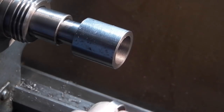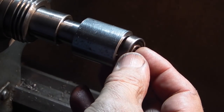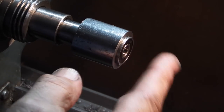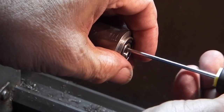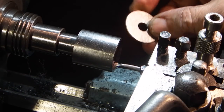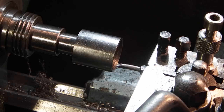I've just finished off the bore. I had to revert to an old boring tool to try and get a decent finish — it's still a rough finish but this bearing now just starts to go in. The material is still hot so I'm hoping it will shrink down a bit when it cools. I've also machined a little recess on the end — about 25.5mm diameter and 2mm deep — that's for the washer to go in. I'll just have to take some off the outside of this washer. I think that's enough for today — we'll finish making this project in part 2. I hope you enjoyed it and we'll see you next time on Innotts Engineering.